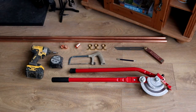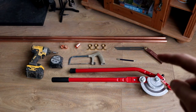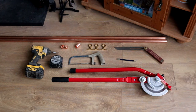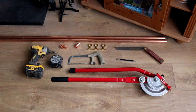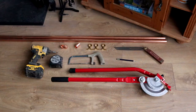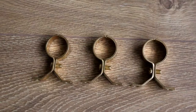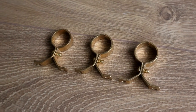The main tool for this I'm going to use is the pipe bender. I'm also going to use my sliding bevel to find my angles. I've also got a couple of pieces of pipe — I've got a few spare pieces so I can make a template. That's going to be critical so I don't waste pipe. I'm going to form this with two pieces of pipe and join them with a straight coupler, and I'll put two stop ends on each side. I'm going to use three clips to fix it to the ceiling.